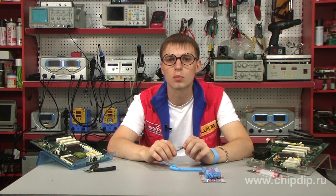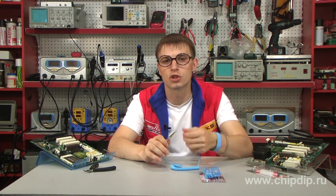Many people do not like to work with an anti-static wrist strap, finding it a bit uncomfortable. But as the experience of production and repair of electronic equipment shows, the anti-static equipment of the workbench should be accepted as a norm. Don't forget to connect the wrist strap to the grounding conductor, as simply wearing this accessory doesn't provide anti-static protection.